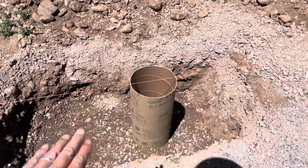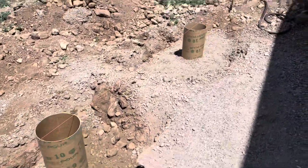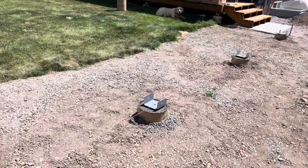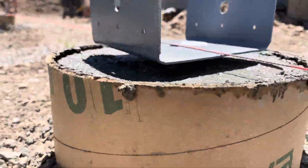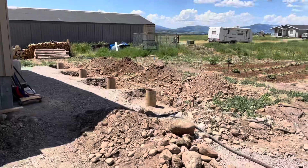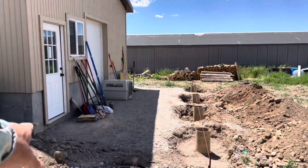We're making progress. We've been filling these two-thirds of the way with road base and tamping as we go, then putting field dirt on and tamping that, then road base on top. These three posts are in with 6x6 brackets in place just off the cement. We'll get these packed and poured today and then form up this cement pad to be poured.